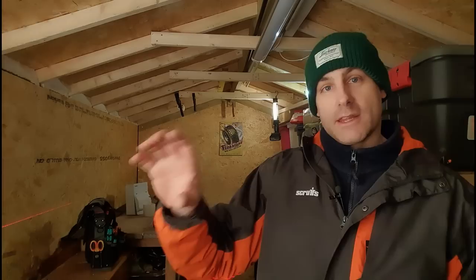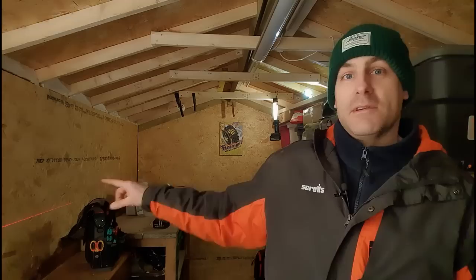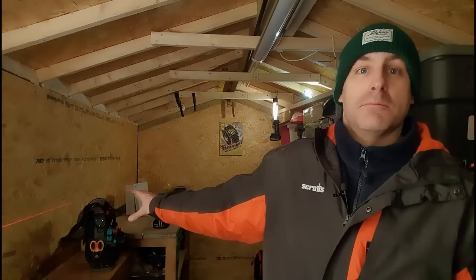Now in terms of wiring, I'm going to keep it pretty basic, pretty simple. This wall only, and maybe a little bit at the back. I'll have sockets, the metal clad sockets, and maybe a USB one at the bottom down there. See how things go, and it's all going to be run in plastic conduit. So it's very simple, very basic.